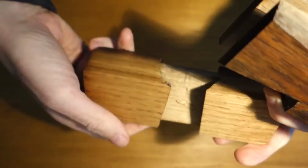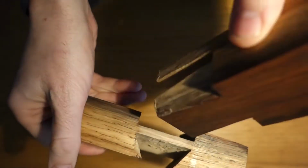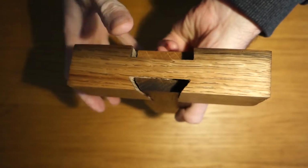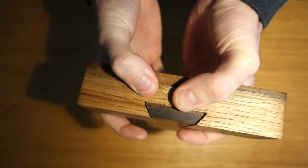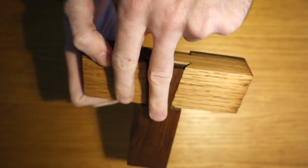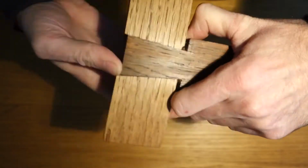And so we now have a bevel, a rising joint. So when this goes in, as you can see, this starts to rise up the joint. And as I say, the key to it is keeping these bevels absolutely perfectly parallel to each other, and then that enables it to slide in and out. So what I've done, it's a little bit tight.